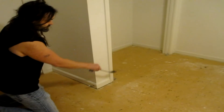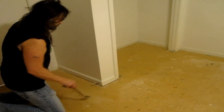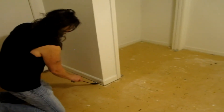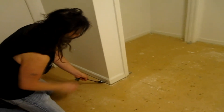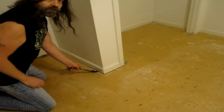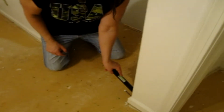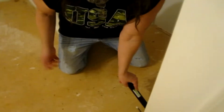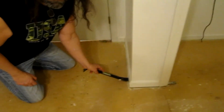I isolated this squeak to right around this area and I suspect it's this wall. So what I'm going to do is push my pry bar on the wall a little bit — I'm almost touching the stud back here. And now I'm going to have Rita walk around. So now the squeak is totally gone, just by putting this pry bar right in there.